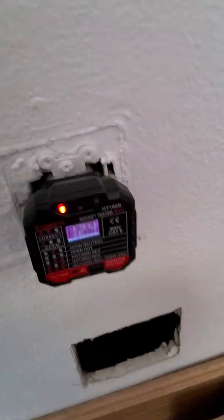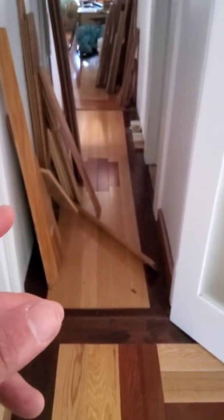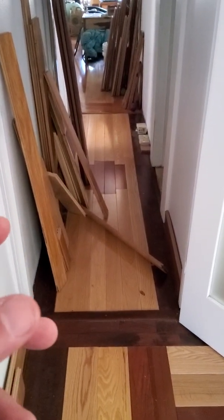We have open grounds here, open ground throughout the house. Obviously, like I mentioned, the floor has dips and there are structural issues underneath the house. The foundation, like right here, I feel like I'm walking downhill. Here I feel like I'm walking uphill. That's because, I believe, right in the area where that one column support is no longer attached. It actually fell down the side. I believe it's right here. I'm almost certain it's right here.